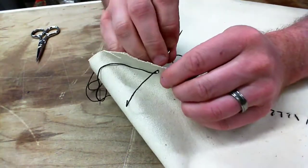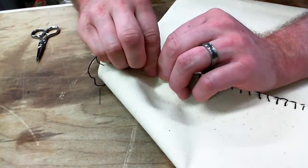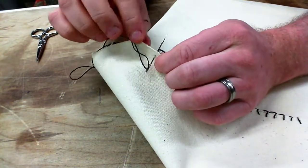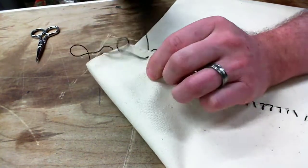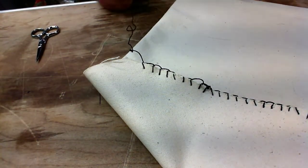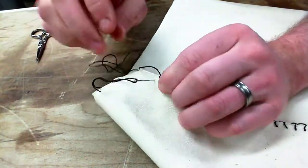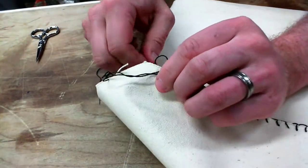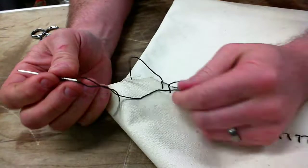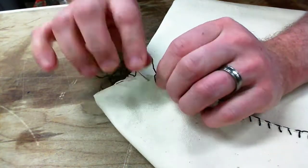And if you screw it up and tie a granny knot, you're going to hear about it in a gentle way. The bowline is a way of making a secure loop on the end of a line, which will come undone just as easily as you made it, which is great because often a bowline is on a mooring line or an anchor line, and it's under a lot of tension. And if you used any other type of loop-making knot, it would be permanent after that. So a bowline can always be broken, and you can make it as successfully in thread as you can with 5-inch cable. It's a great knot to know.